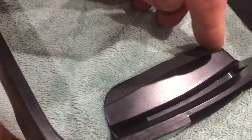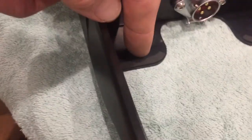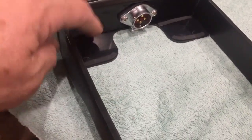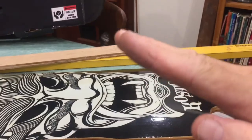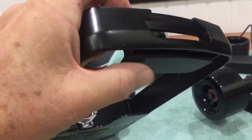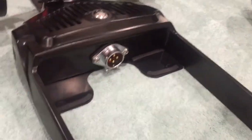That's the half-round one — it's like a jigsaw puzzle, it fits perfectly, with the same tapered edges. These ones kind of go around there. I'm going to put these two straight ones at the back, just at the back there. So when the battery goes in and clicks in, it foams and rubbers it, so it doesn't vibrate as much. The plastic battery compartment sits on the board, and as the board flexes, this part will cantilever, so there could be some tapping — that's why they've put rubber in there.